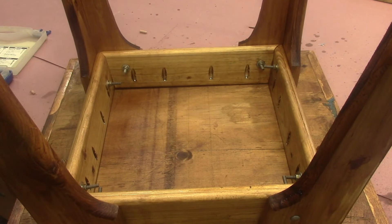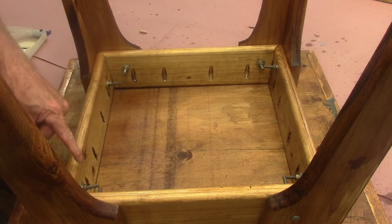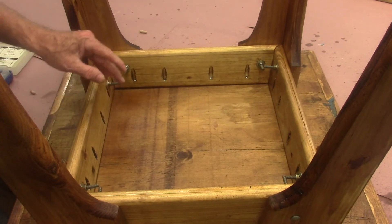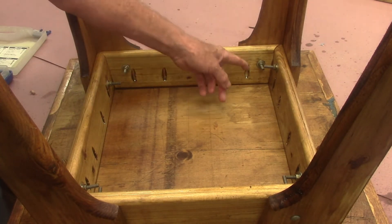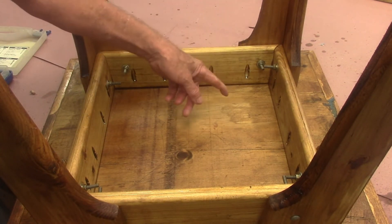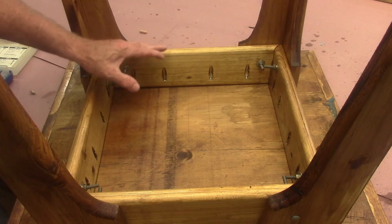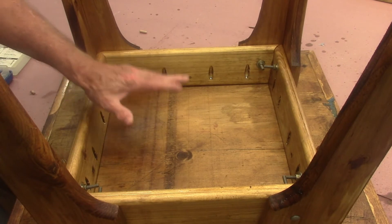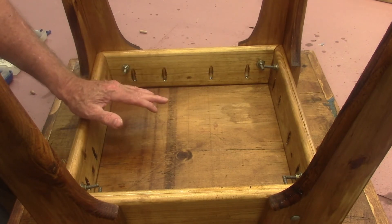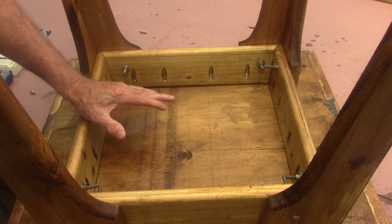I know we're flat out of time, but one more quick look at how this thing is set up: you put the splayed angle frame in place, attach it with pocket holes, and then you do your splayed angled legs — I showed you how to do that — and those just bolt with carriage bolts right into this frame. That makes this table just indestructible and would be great for a shop table, or not a camping table because it's too heavy, but this is going to be used on a deck.